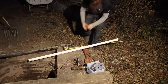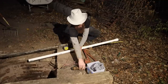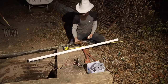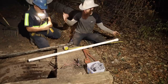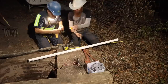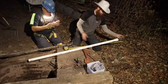So the plan here is, this is our actual ejector. We're going to extend off the ejector down so we can put the foot valve, which has a check ball in it, and it's what keeps our prime. This is also where the water sucks out of to go up. Instead of this being attached like that, we're going to extend it down to whatever number he measured. So we're going to PVC glue that into here, or pipe dope it and Teflon tape it. And then we're going to cut this pipe, and it'll glue into that side, and then this will glue into here, and we'll thread that right like that.